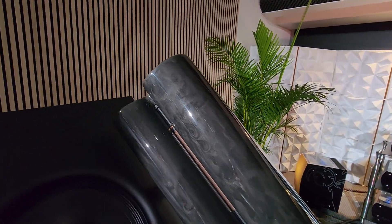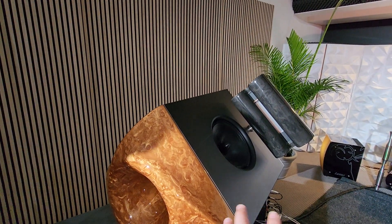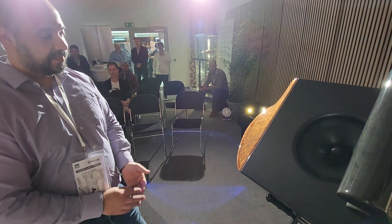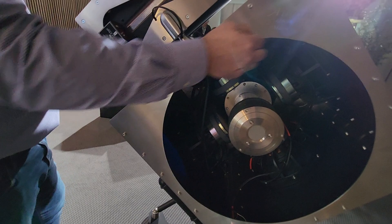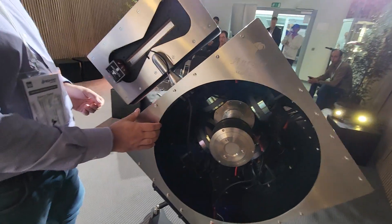The carbon is equally cool. But the other brilliance to me, even more so in some respects, is how you did your kind of quasi-open baffle bass. One of the main reasons I started this project was to play around and see what's the best non-buzz horn bass module we can design. We quickly discarded every isobaric or closed bass reflex solution. I was intrigued by open baffle, but what I found is that they lacked dynamics and low-end — it's just impossible to get low-end from an open baffle. So we came with the idea that if you roll back a baffle, you get back pressure, because you have the restriction here and this surface is less than the total of the cone area. So what you can do is create some back pressure.